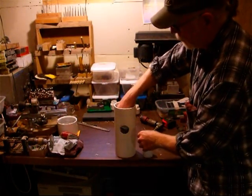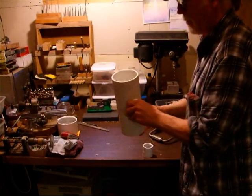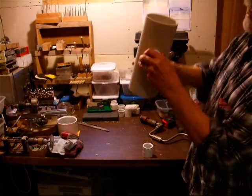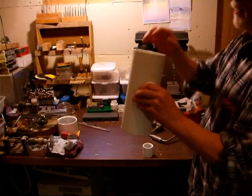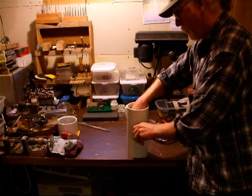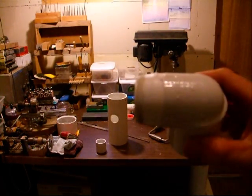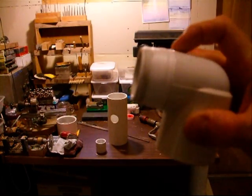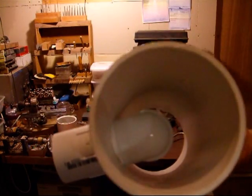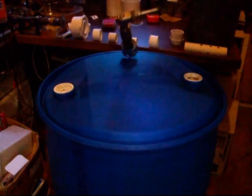This is an inch and a half threaded female adapter and this is an inch and a half threaded male adapter at 90 degrees. It's going to go on the inside and slide through this hole — it'll be a little bit tight but when assembled on the diverter we want the open side down, not up, because we want the water to come up through there. This is going to thread on like this with pipe tape on it — this is what it's going to look like when you've got it done.